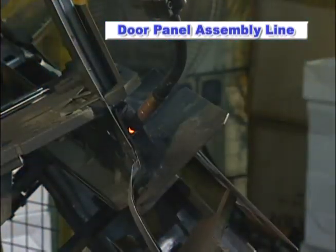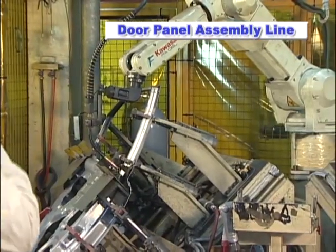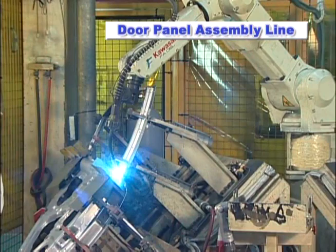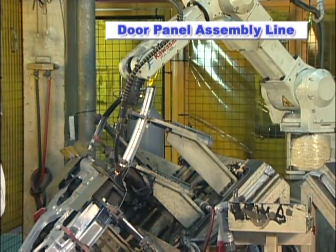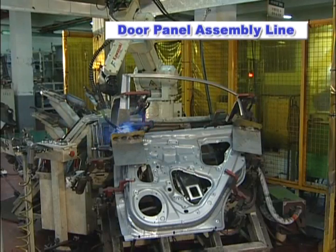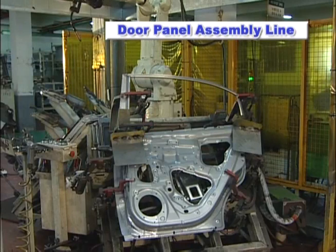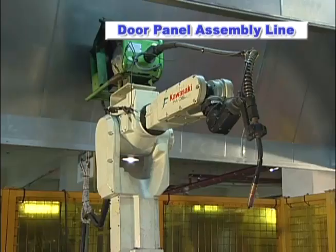The wide range of motion and smooth trajectory control characteristic of the FA-6L provides a smooth welding motion even from the complex corners particular to automotive doors, resulting in excellent weld beads. When the welding is complete, the FA-6L goes back to its stand-by position and the jig unclamps the part. The operator visually checks the appearance of the product.